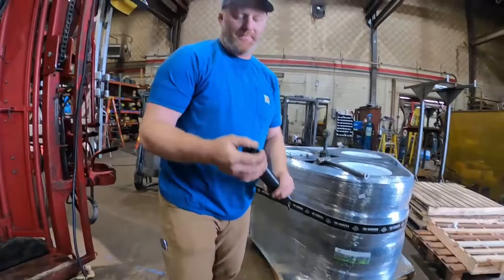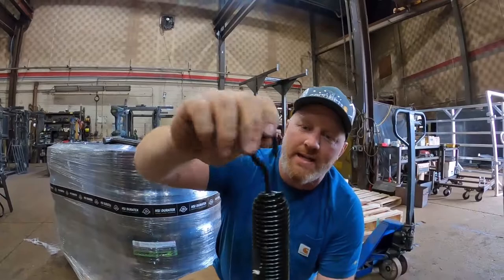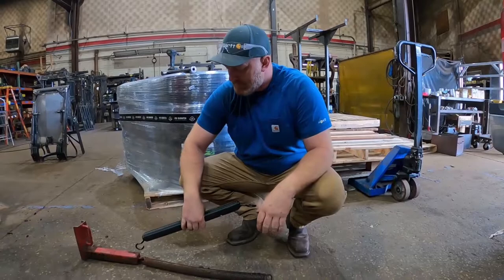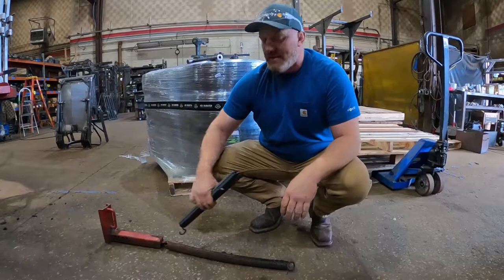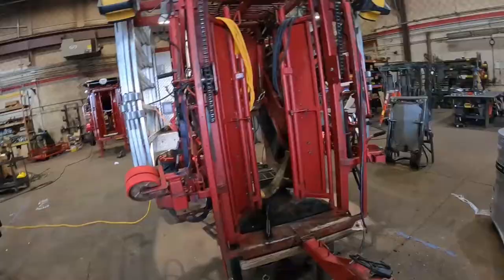There's a new design on these front jack tube springs. It doesn't have that — they just bent the top of the spring up so you can hook into it. This one here has an independent piece with a little cup on the inside, so it doesn't have that breaking point — it puts a lot less tension on the top and bottom. So what we'll do is cut this off and then grease it up real good so that whenever it has to come out again, it'll slide right back out. Pretty impressed with this chute — usually that's a little rustier setup. Wonderful example of how to maintain your chute.